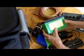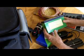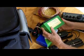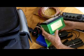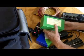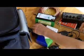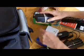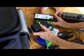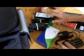This is a lithium iron phosphate battery. It's rated at 12.6 volts, 6.4 amp hours, and it's really light — much lighter than the equivalent power lead-acid battery, so I've been happy with this. Whether I really need it for the sort of operating I do is debatable, but it seemed like a good thing to get. Here is the charger to go with the battery. With these two together, this is the equivalent of any nice power supply that you might use with your KX3.